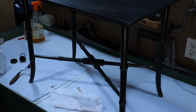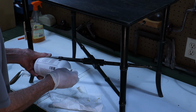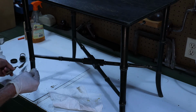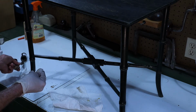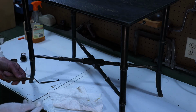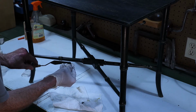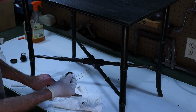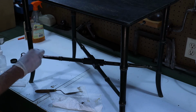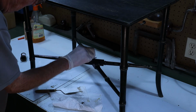And now I'm going to go ahead and charge it with a little bit of the spot padding finish, which is a shellac lacquer based, quick drying, thin filmed type of rub-on finish. And that is a little bit of black aniline dye powder. Now normally I would never put the powder on so concentrated, but this is an ebonized piece. It is black, and that's what I'm doing, ebonizing it with aniline powder and my little rubber.